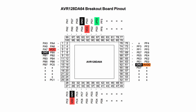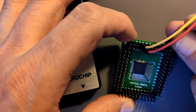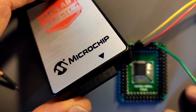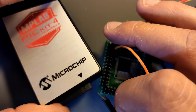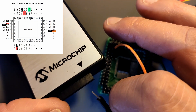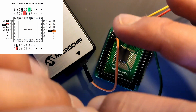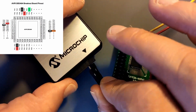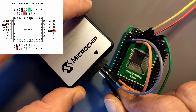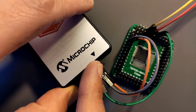I've made a quick breakout board pinout diagram. There is VCC on pin 92, so let's connect that, and on pin 93 there is ground. UPDI is on pin 87. The PICkit 4 by default doesn't supply a voltage from its positive voltage pin — it's only used for sensing — so I'm connecting another jumper wire from pin 6 on the breakout board, which is also VCC, to the PICkit pin 2.